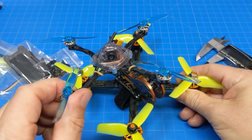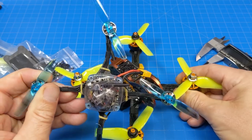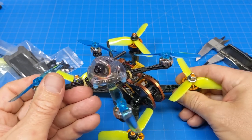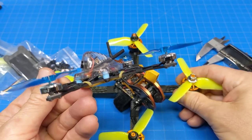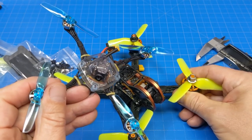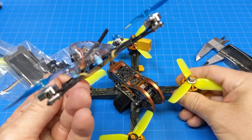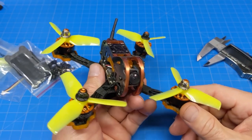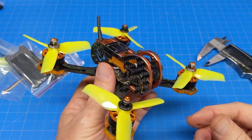By the way, if you're here all the way at the end — the T-Motor Feather 120 burned up when I plugged in a 2S battery. As far as this being 2S-compatible, I am in contact with T-Motor and I did let them know — they were very surprised. I wanted to try it on bi-blades but couldn't get the blades down very far since they're really tight on those motors. The flight controller said 2S and 1S and 2S, so if I should do a separate video, let me know.